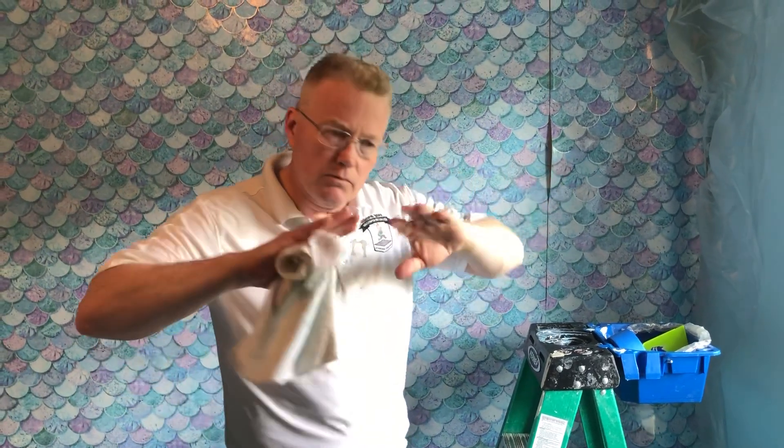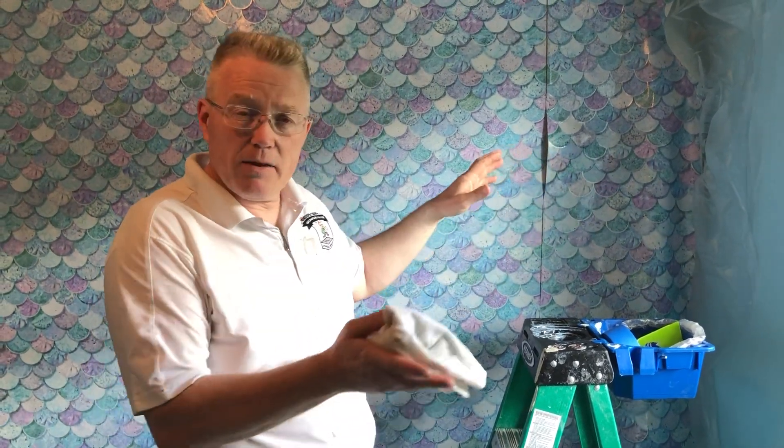If you can't protect it, wallpaper the next day — that way you can wipe down paint that was painted yesterday. When you're doing it hours later, there are several layers of paint that need to cure. The first two top layers are dry to the touch, but if you press with your nail, you'll come up with paint on your finger. The two layers underneath are still wet and none of it's cured yet. You need at least 16 hours before it's cured; I would give it 24.